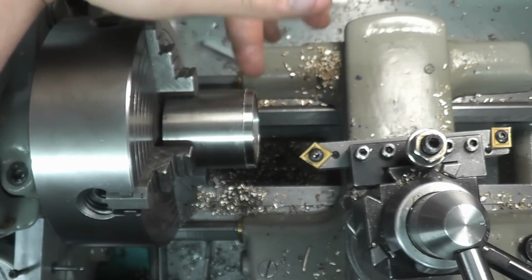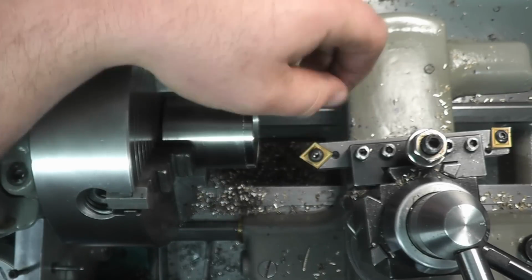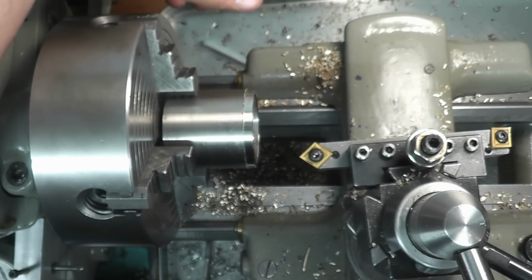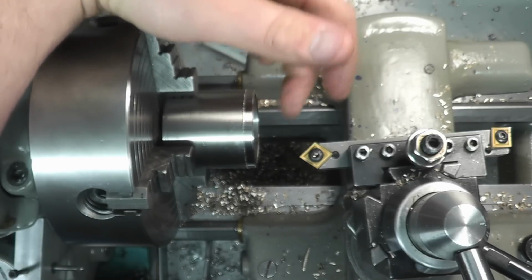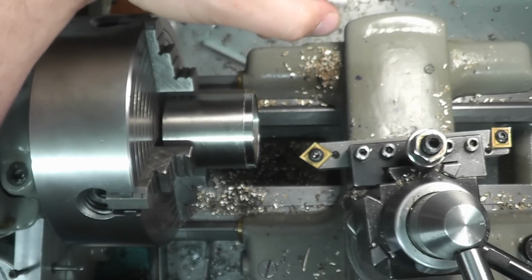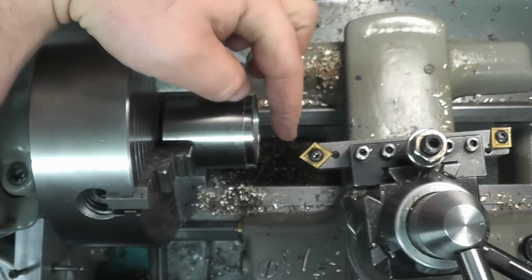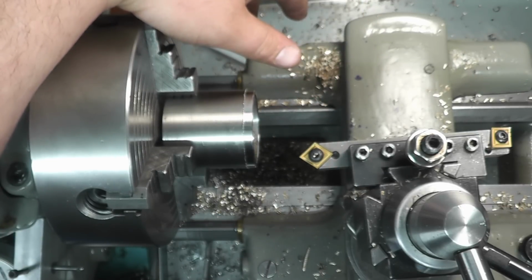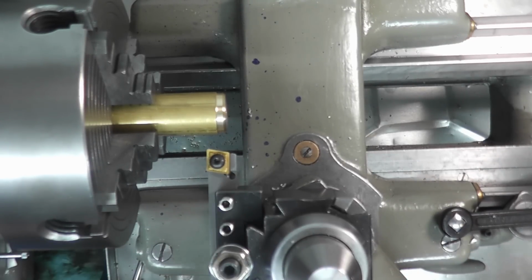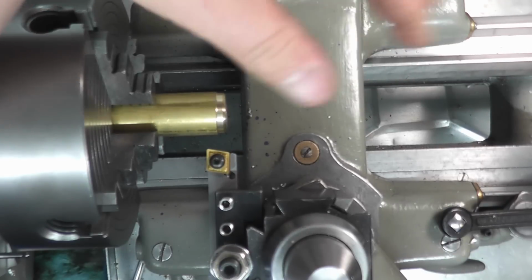So what we'll do now is set up, and this is stainless steel and they made a perfect finish on that. We'll turn some, starting with something soft. We'll start with brass and see what the aluminum and the steel tool holder do. Then we'll put a piece of steel in here and actually measure the deflection of the steel tool versus the aluminum tool. For every test we're going to be doing the steel tool first, and then I'll cut the steel with a really deep cut, and we'll measure deflection between the steel and the aluminum tool.